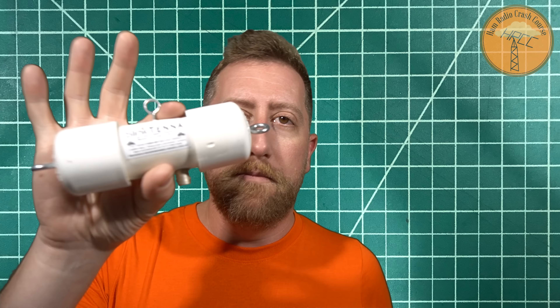That kind of makes sense — that's a 20 meter cut dipole for that band, and this is a multi-band slinky antenna, which is a little quirky, a little different. You're going to get some different performance there. The dipole is going to work better on 20 but works on nothing else. The Slinktenna is going to work on 80 through 6 — so a bit of a compromise to get all the bands in, but I think you expect that.